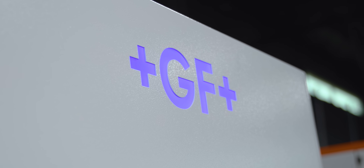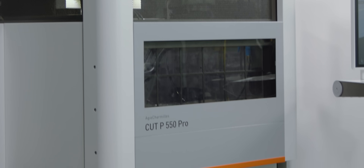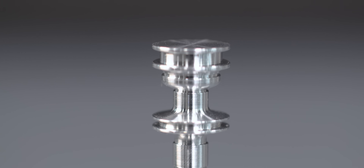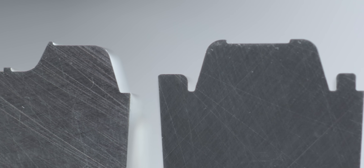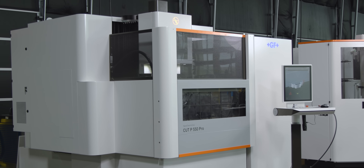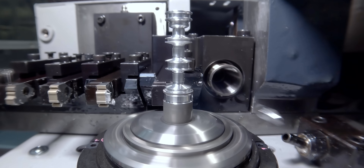I'm extremely impressed at how good these tools came out — first try off the GF, that machine is insane. And honestly, it was so easy on the Tornos: set the tools up, write a little code, plunge right in, and now we have a beautiful pneumatic spool valve. If you're making a part with thin grooves and different angles all over the place, you definitely want to consider using form tools. And if you don't have an EDM at your shop, Horn does make custom tools, so check them out. This is another example of combining different technologies under one roof to improve the process in our Swiss department. Look for those opportunities in your own shops. Thank you for watching — please like and subscribe, and if you want to talk more about Swiss machining, join our Discord where Donnie is always there answering questions.